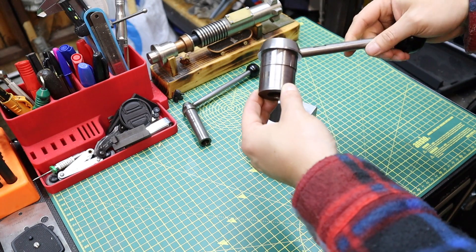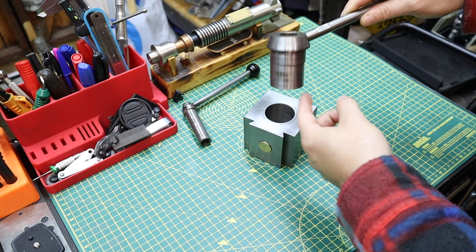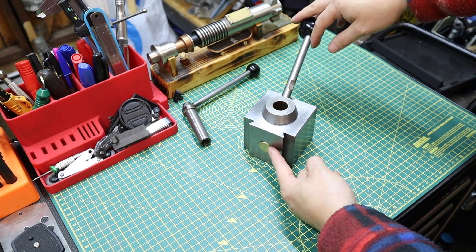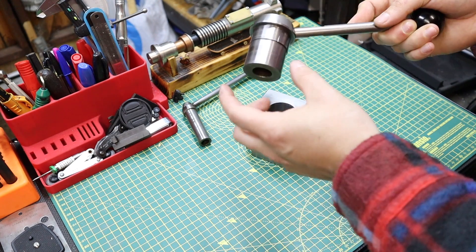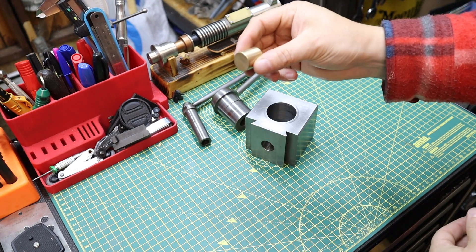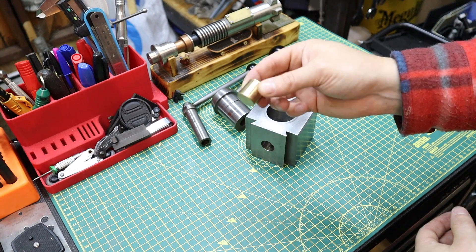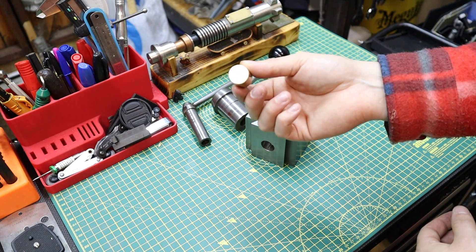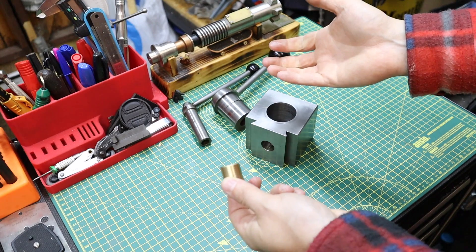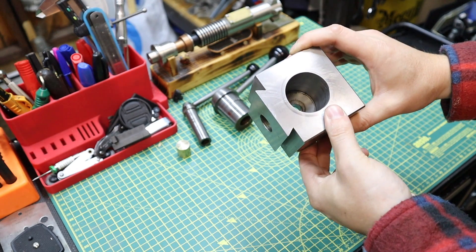Now looking at this piece in particular - this is what makes this thing work as well as it does. This portion acts like a cam lobe that you see on a car. By having a slight offset, when this is rotated, the locking pin down here gets pushed out, and as you go down it retracts. Without this offset lobe feature, the tool post just wouldn't work. The locking pin itself is a simple part - it's a piece of 18mm round brass, designed out of brass because it's softer than steel, so hopefully it wears out before the tool post or tool holders.